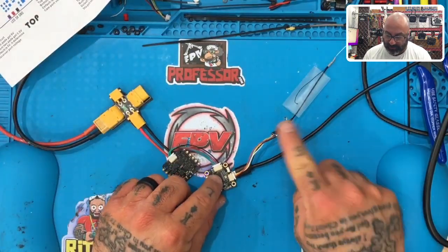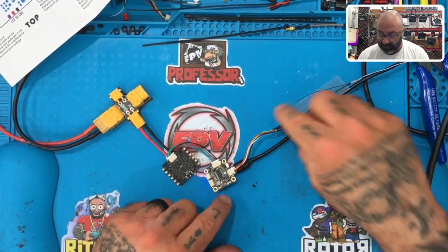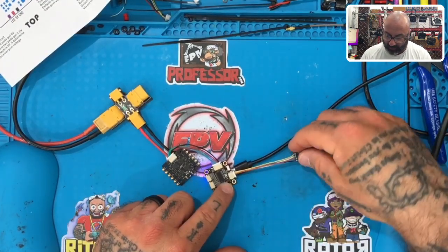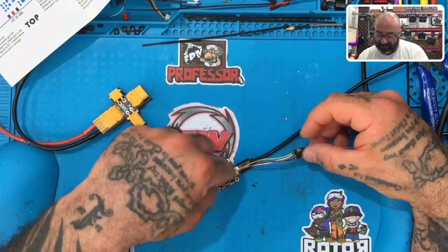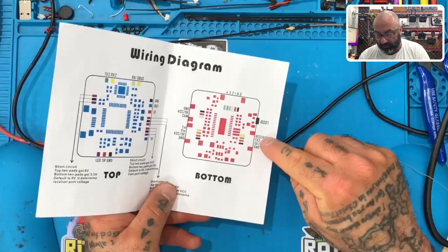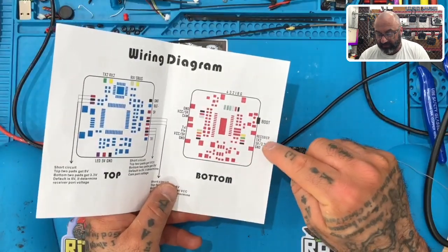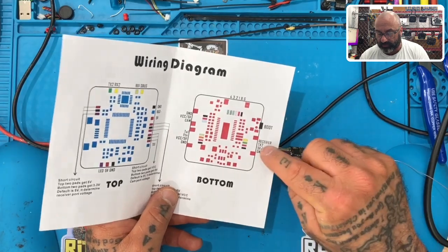So if you're going to use this plug and go into UART3, you're going to plug that in and wire it accordingly. If you're using the plug here, the yellow is going to go to the TX, the white goes to the RX, and the order here is RX, TX, five volt, and ground. Just remember, this is UART3, not UART2.